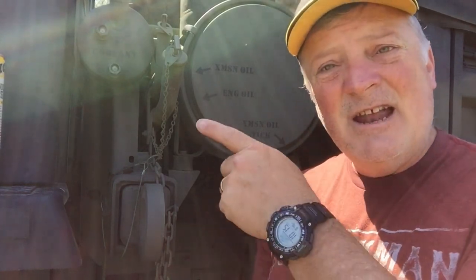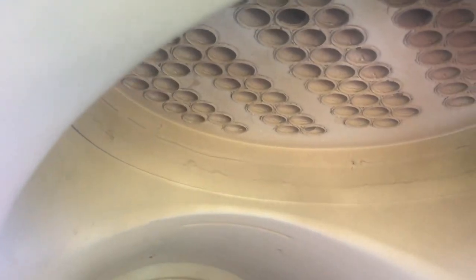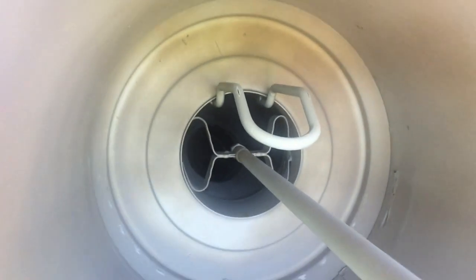While I'm at it, I might as well go ahead and pop this off and check the air filter for cleanliness. I know that I have a gauge up front, but there were some bugs that kind of went through there. I'll bet they're in the plenum, but I also just want to make sure there's nothing else in here either. Well, I think it's a good thing that I checked — there's a bunch of bees at the very bottom. And indeed, if you look up, there's the bottom of the plenum. Air comes flying down the center, whatever junk gets thrown to the side gets ejected out through the ejection port — that other part that I showed you on Patricia. I'm going to go ahead and vacuum this out and get rid of all this stuff. After doing a once-over on the filter and vacuuming out one or two bees that were still stuck in this thing, this looks in really good condition. The thing is monstrous. Time to put her back in.